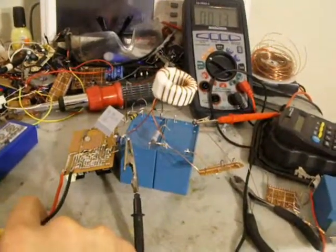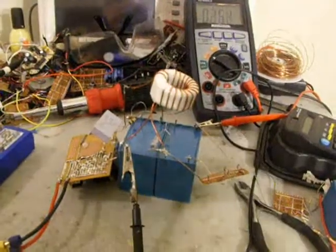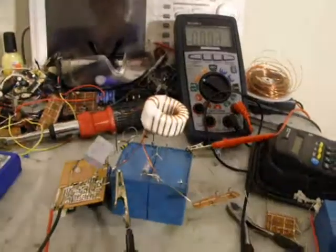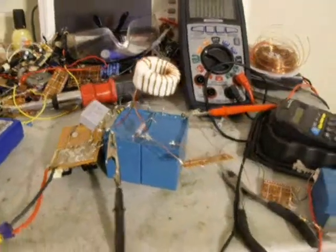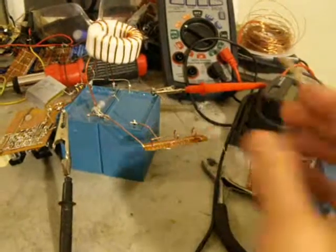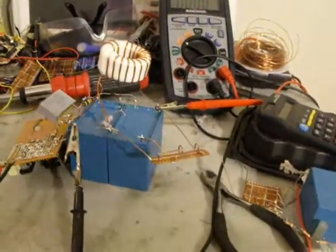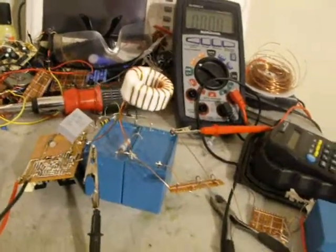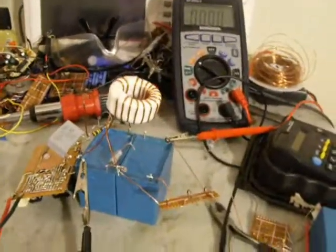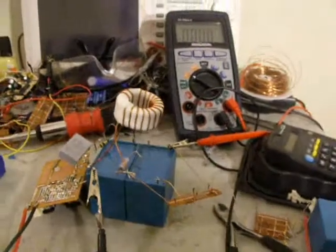It's not just a lucky case that this happened. Here we go — one, two, and a third shot. Disconnecting the charger to see the voltage left. Zero volts left. As you can see, the distance between those two electrodes could maybe be even bigger. The distance could be really large, to have a big chamber with two electrodes used to produce a big plasma expansion and propel the projectile with really high pressure. If you like this, you can copy the technology and try to make an electro-thermal gun operating on air only, without any aluminum foil. Maybe this will be a promising technology from now on. Thanks for watching!